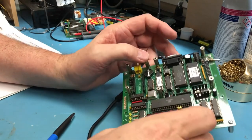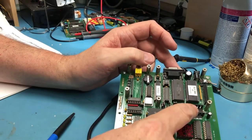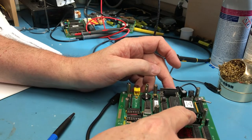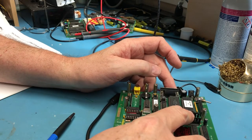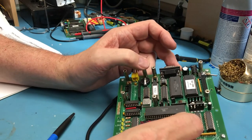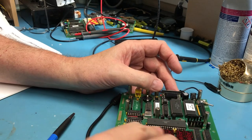You know, thermally, it's drawing 600 milliamps and there's 9 volts coming in, so it's dissipating 4 volts at 600 milliamps. So what's that, 2.4 watts? So it's going to get warm. Not dramatically warm, but it will get warm. Anyhow,